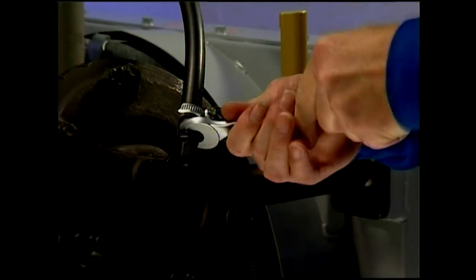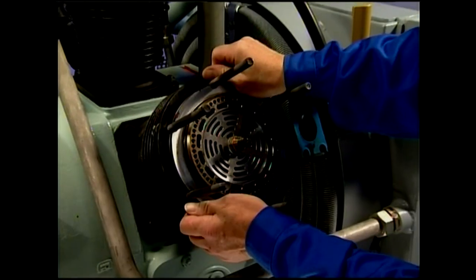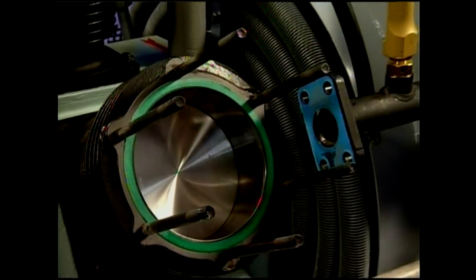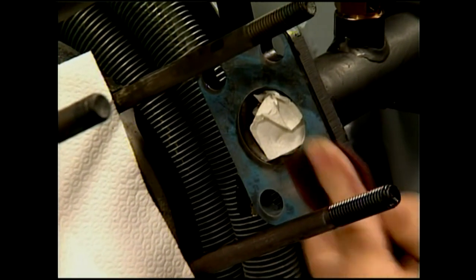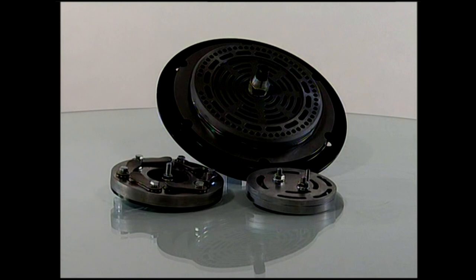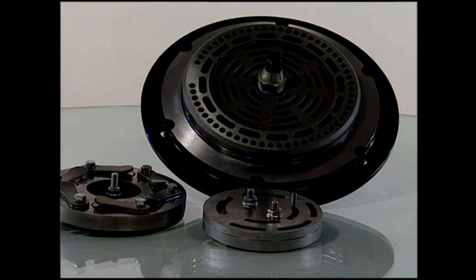Firstly, the pipe joints and hose lines on the cylinder heads, as well as the cylinder head nuts, must be loosened to remove the cylinder head. Then carefully take the valve out and clean all gasket surfaces thoroughly, again using care. The concentric and lamellar valves are combined suction and delivery valves. The suction side is located on the inside. The delivery or pressure side is the outer annulus.